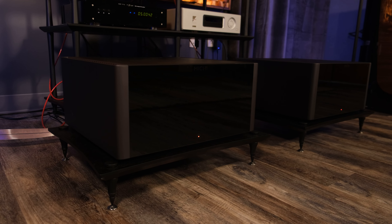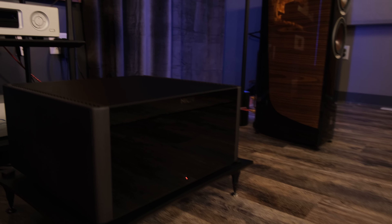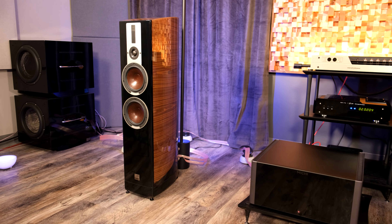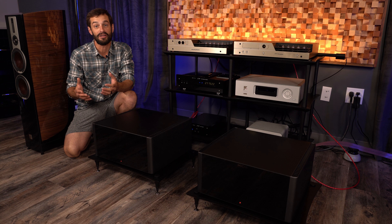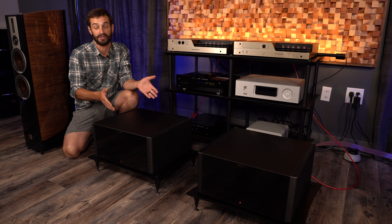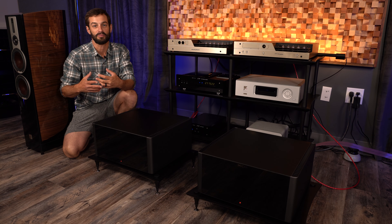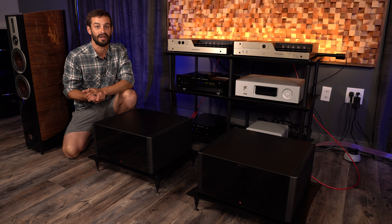The Michi M8 monoblocks can put out a heart-stopping 1800 watts per channel into 4-ohm speakers. The Dali speakers being 5 ohms nominally means we're getting almost all of that in here. The amps have silent fans on the back which engage when tons of power is being drawn, but the Dali Epicon 6s are not current hungry or insensitive. The M8s are hardly breaking a sweat in this room, but the sonic effects of having that much power on hand are still felt and heard. In mono products like these, power supplies don't share power to another channel, and the design features 32 transistors on the output, spreading out the work and allowing for much lower output impedance.